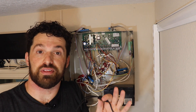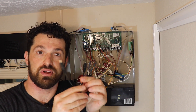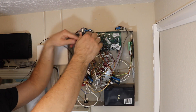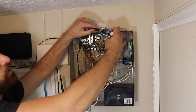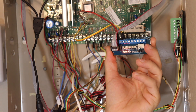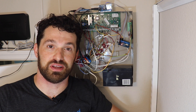Now we need to power both alarm panel Wi-Fi boards. Your kit comes with a DC splitter for the number of boards you have, which makes it really simple. Plug into the DC splitter and each board is powered — they both light up. You'll see the zone LEDs light up again on these programmable outputs, and these are going to be tuned in exactly the same way.